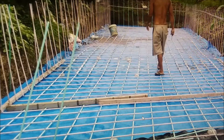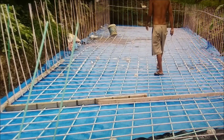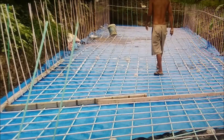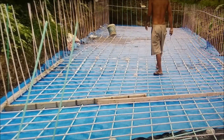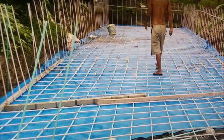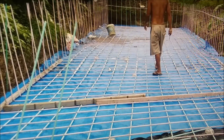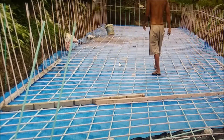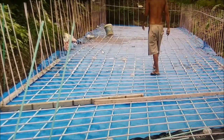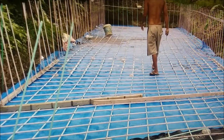Maybe they'd like to be able to walk on it. These holes are kind of small to put your foot through to get it flat on the ground, so maybe it's easier just to force that tie under there and pull it up and wrap it. It looks to me like there's about an inch and a quarter rise here, a little low spot there. Instead of pouring this floor six inches, I told them a couple weeks ago we're going to pour it eight. Six would be plenty, five would be enough, because there's a footer that goes around, and it's just a little overkill — there's plenty of bars in it. Another thing to look at is these bars come over and then they bend up — the wall ties the walls to the floor.